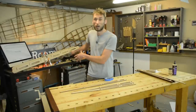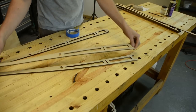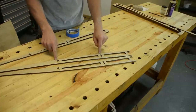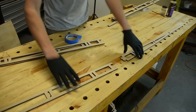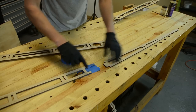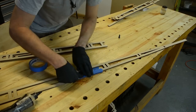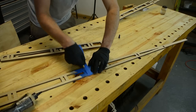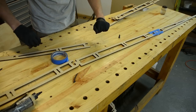While the spines are glued up and drying, we can turn our attention to the rails. You'll notice that you have two identical pieces in profile but they are actually reversed — the lettering is on the top on one and on the bottom on the other, because one is the left side and one is the right side. To start, I'm going to apply tape across the joint on the underside, then apply glue to the faces, press it together, put the tape on and stretch it nice and tight, with a wrap around the joint for additional support. I'll repeat that for the remaining joints on both sides.